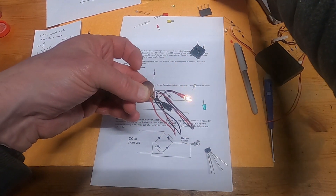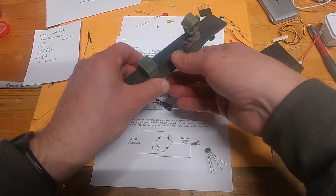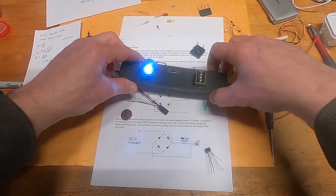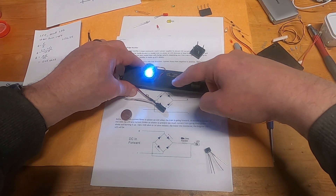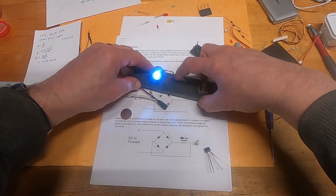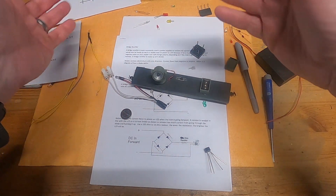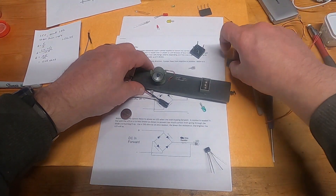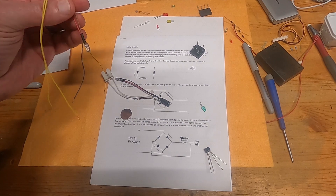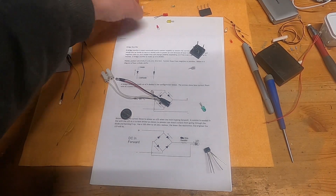I wanted to make another one of these searchlight cars and put one of those color-changing LEDs in it for Christmas. On my existing searchlight car, instead of using track power, I put three of these little batteries in here — that equals four and a half volts — so you don't really need a resistor at that voltage. It's not using track power, just powers off those three batteries. I like this because the track-powered version slows the train down. I'll pre-wire a couple of these — solder them, put some shrink tubing on — so when I need them I have them ready.